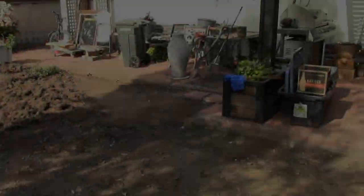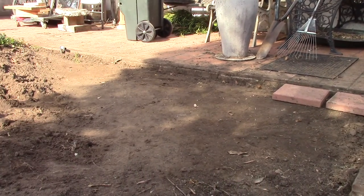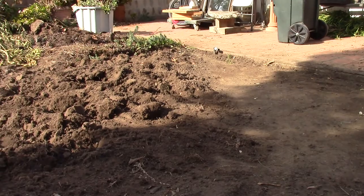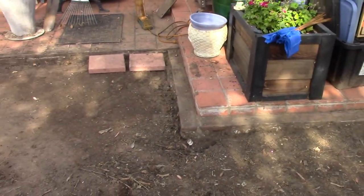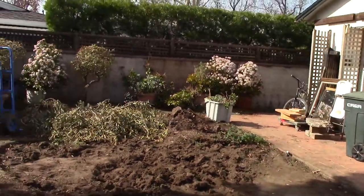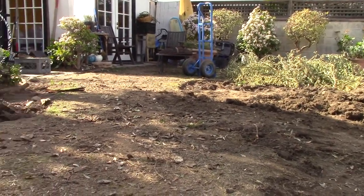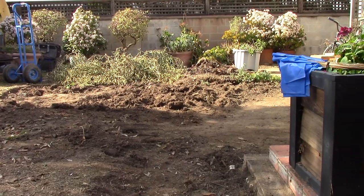I'm getting started on this corner — this is where the water is going to enter the yard. I'm going to lay these concrete tiles down and I've been grading with the flathead shovel, making sure water will flow from that corner into this basin, as well as along this patio. I need to dig a shallow ditch to direct water from over there into this basin as well. There's an elevation change here of five or six inches, so I may have to cut some of this mound — as I dig it'll take shape on its own.